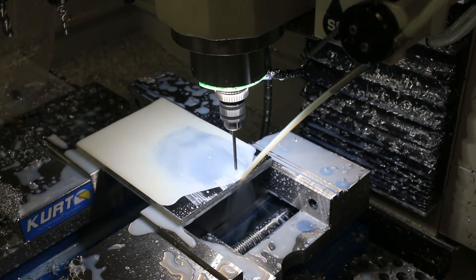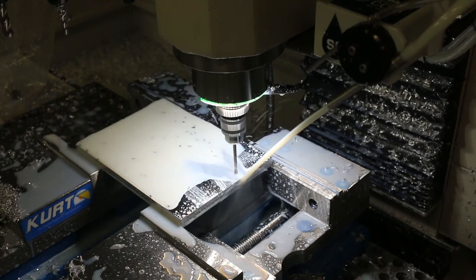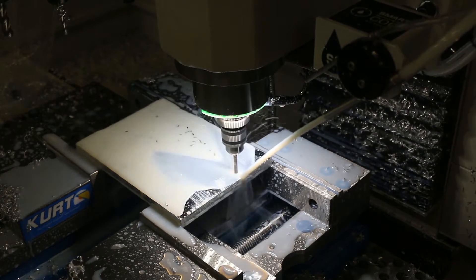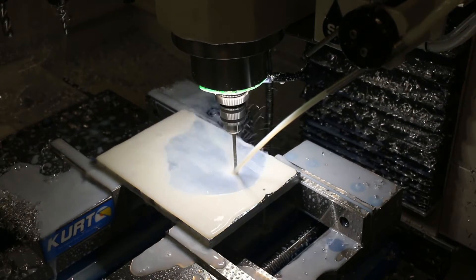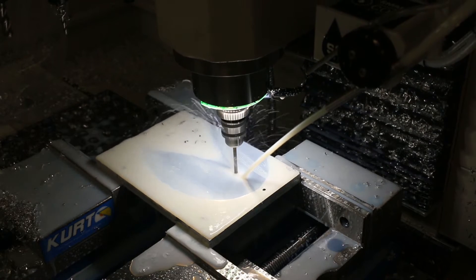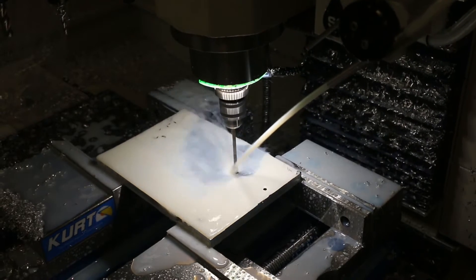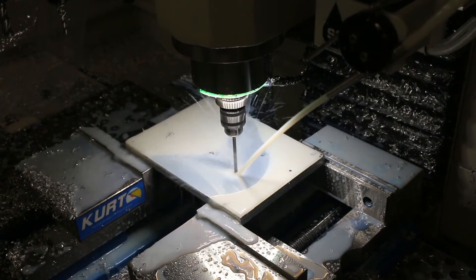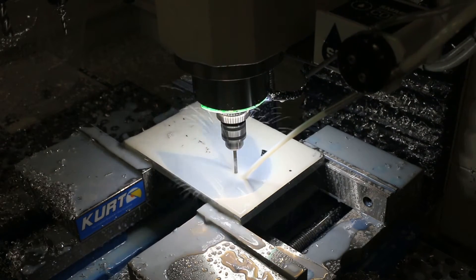If you were doing this close to the edge as we're seeing here, I'd probably adjust that in the code to be a little bit higher. When we get to tapping, you'll see it stays a little bit too far below and doesn't actually get on top of the plate, which is the key. We're also starting to see signs of a pressure drop issue, which we'll see more clearly in the tapping operation.